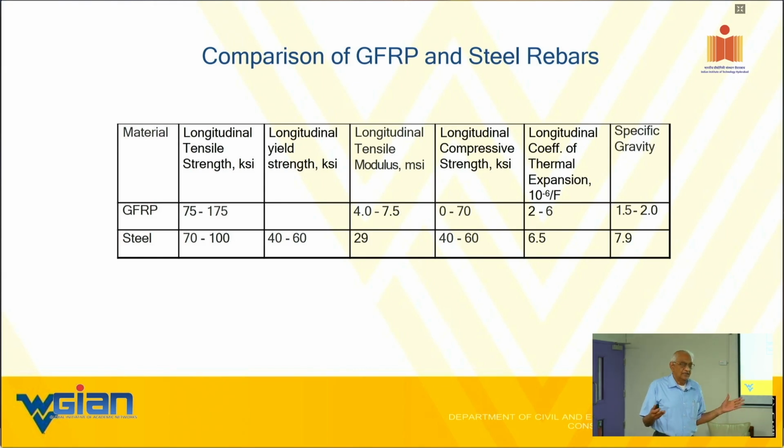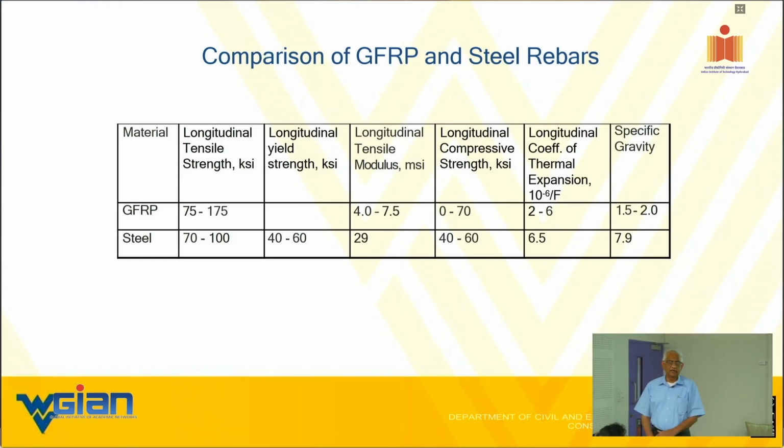That's all. Whether it is E-glass or S-glass or AR glass or carbon for that matter, when it comes to the modulus or the stiffness, it is always as simple as: what is the stiffness of the composite? Volume of the fiber times the modulus plus volume of the matrix times the matrix modulus. It's as simple as that. Of course, we are implying without speaking that the void percentage is about 1% or less. That's what our preference is.